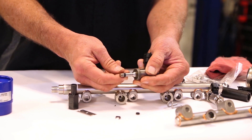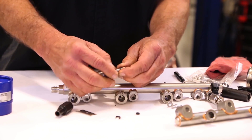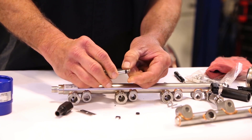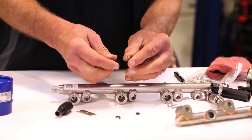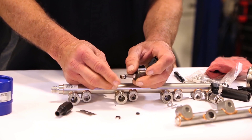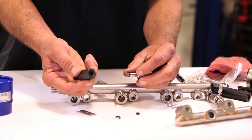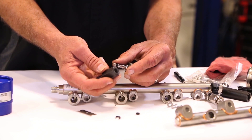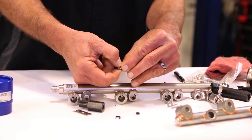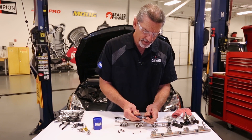But now you can see the seal is actually too large. So what I need to do is use my fingers and try to compress the seal back down to normal size — at least get it started just using my fingers. It's still too large to go into the hole in the cylinder head though. So the next step, the inside of the same tool is a reverse cone that will actually shrink the seal back down to original size as I shove it on. So let's give this a shot. Now we'll shrink it back down to original.